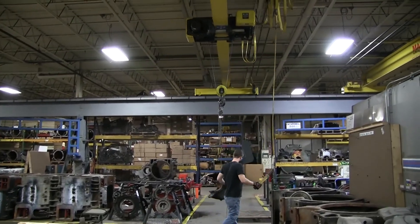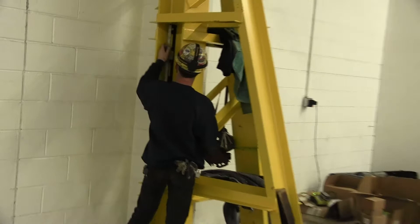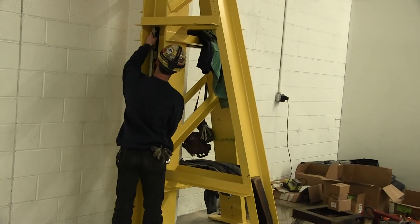So why would somebody favor one design over the other? Favorability really comes down to floor space. An under-running crane hangs from the ceiling or structure, so you don't necessarily have to have columns that take up your floor space. Top-running cranes require some sort of support structure, and if a building isn't designed to support that crane, you have to have support columns mounted to the floor, in essence taking up more floor space.